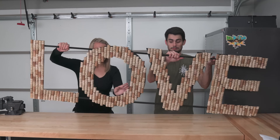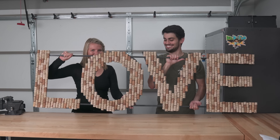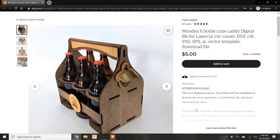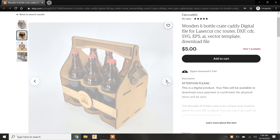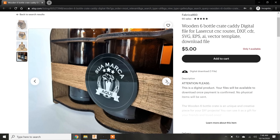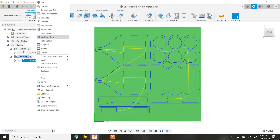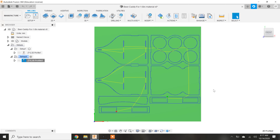One of the reasons this video took so long to release was because the love sign was a surprise and I couldn't put this video up until after the wedding. My next project with the Cut 50L comes from Etsy — I found a DXF file for a beer caddy. It's basically a metal version of the cardboard six-packs you get from the store. The plasma cutter has a duty cycle of 60% at 40 amps. Cutting out all the parts for this beer caddy was estimated to be about 6 minutes, so this would be a great way to verify the manufacturer's claim.